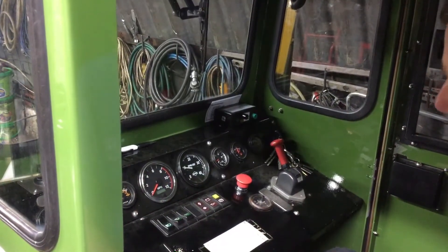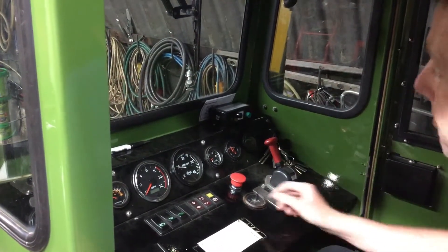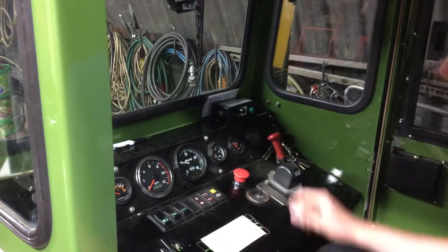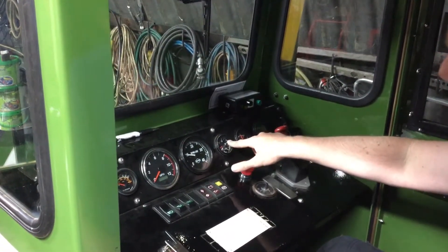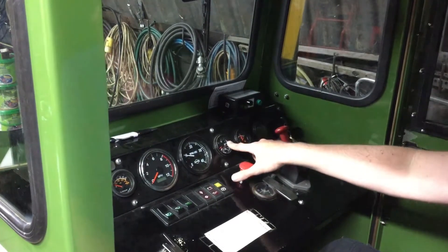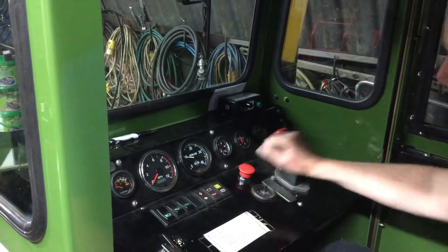So I'm now in the cab. I've got the keys in. Before I can drive it off I've got to start up, but I need to make sure I've got enough air for the brakes to work. I'm going to start it up and build some air — so that red needle gets past the 90 mark. That means I've got air to move the train out and air to stop using the brakes.